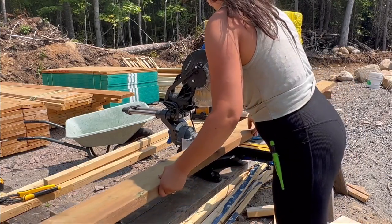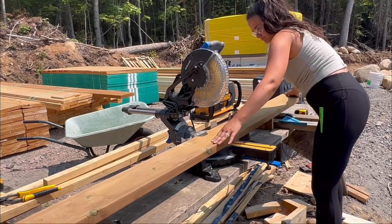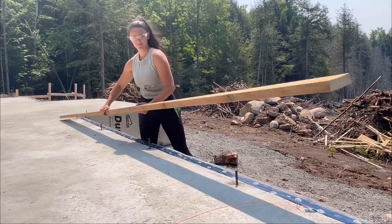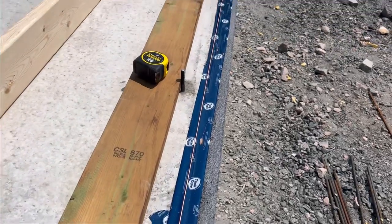The code in our area requires that all exterior wall base plates on concrete slabs must be pressure treated. This is because of the moisture and it also deters pests. Next up I'm gonna pre-drill all of the holes for the anchor bolts in my base plate so that I don't have to do it later when we go to stand up the wall.